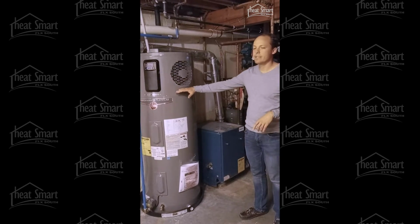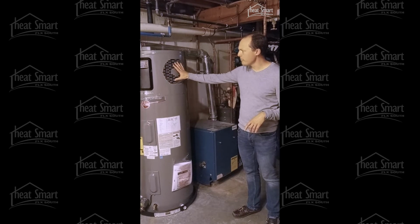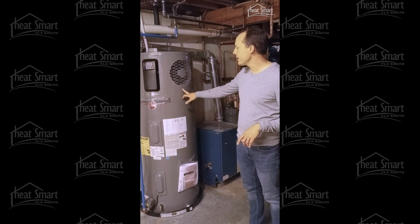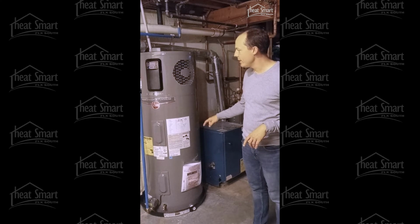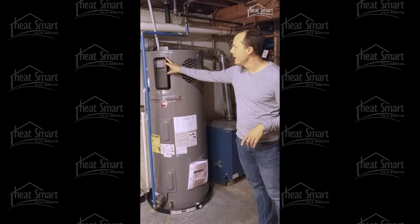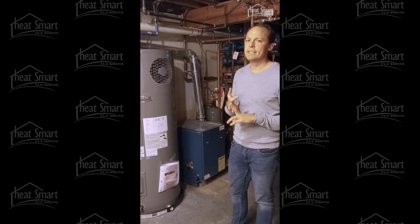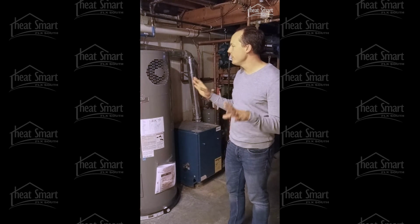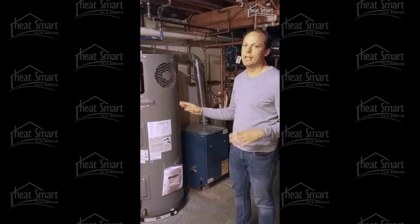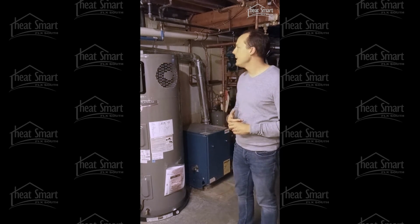I think the older ones have a lot less insulation, as well as this top part here is part of the hybrid system, so this is where the heat pump is located. It does also have electric induction coils in it as well, so you can use those in tandem. So you can choose different settings on here. You have high demand settings, eco modes, heat pump only settings, vacation mode. So it'll use a certain percentage of each of those to try to keep up with demand. So if you're in high demand, it's going to use a lot more electricity than if it's in the heat pump mode only.